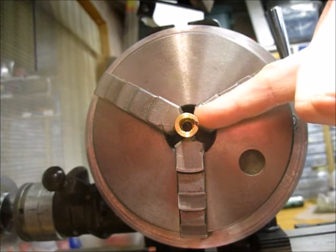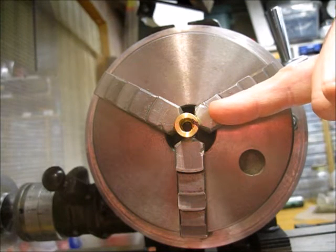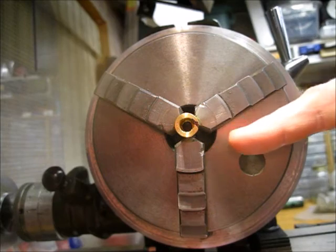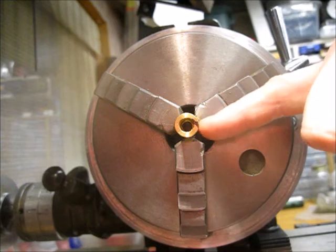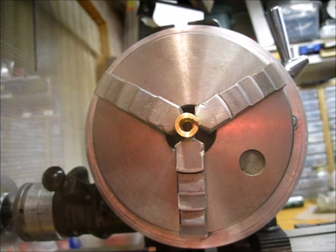So I'm going to add a little pin partway in to give me a stop to go up against the stepper motor shaft, and then drill the 3 spots for the ball bearings that actually hold the nozzle in. On this one I'll probably drill 6, since this is a bad part, so that way I can get 6 tries to get my depth on those holes correct for the ball bearings before I have to go to a real part. Here we go.